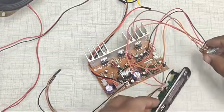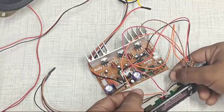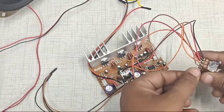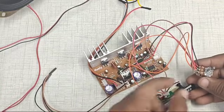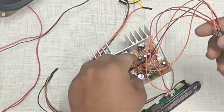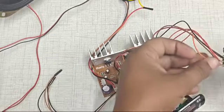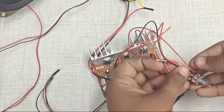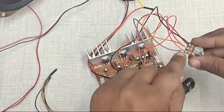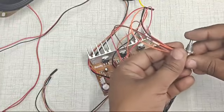We also have to connect the upper and lower pins of pin 3 together. The input wires — the leftmost (pin 1) and rightmost (pin 3) wires — connect to the upper and lower sides of pin 1 of the potentiometer. The yellow wire connects on the upper side and the red wire on the lower side. The other two wires from the amplifier board (other than the black wire) connect to pin 2 of the potentiometer — the red wire on the upper side and the yellow wire on the lower side of pin 2.